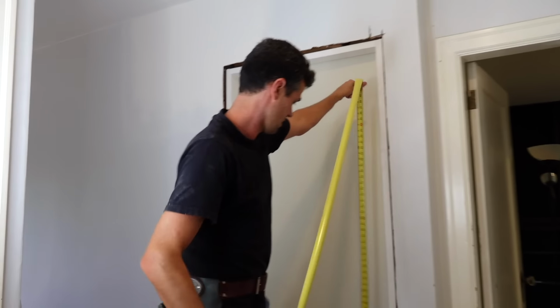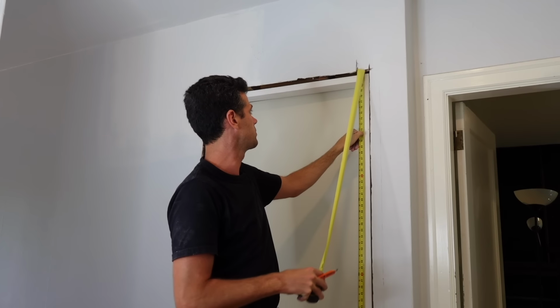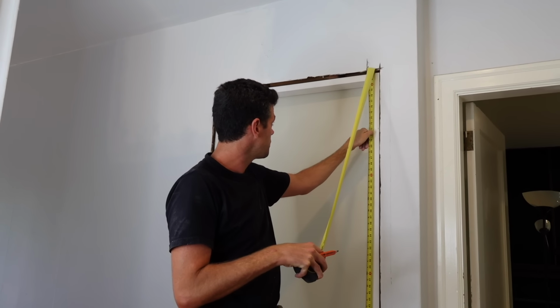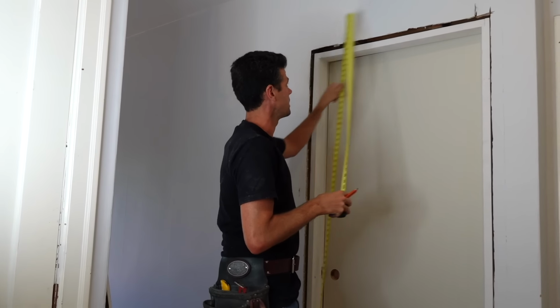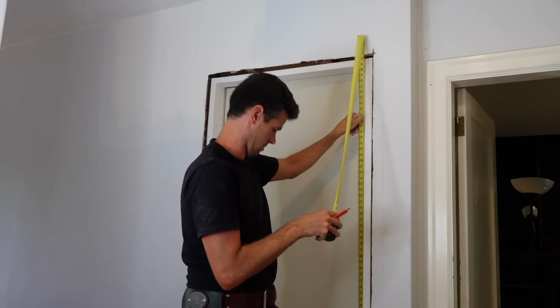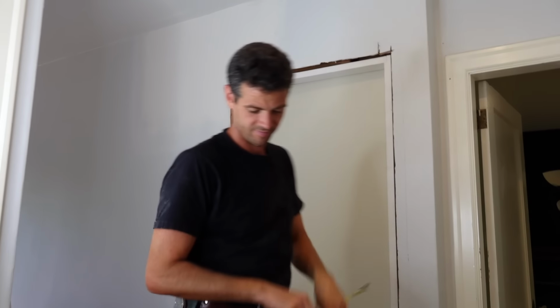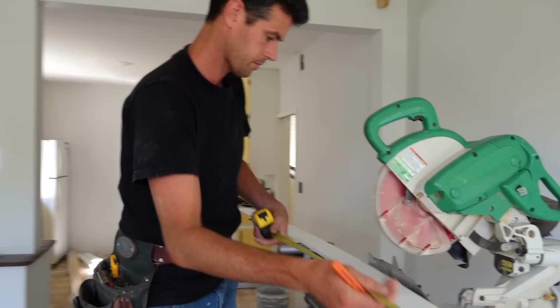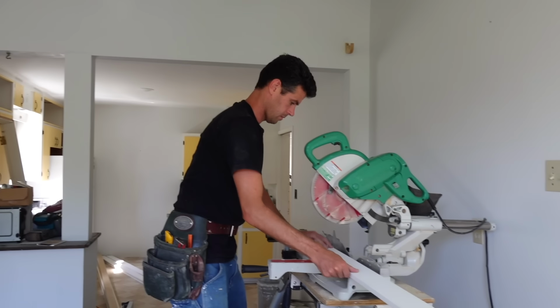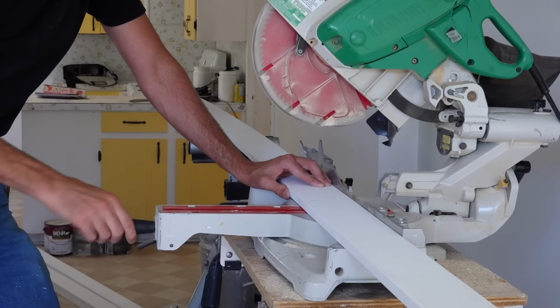So now I'm gonna do that real quick. But let's cut it a little bit long. We can do it to 83. Well, I need to cut it a bunch? 82? 82 is looking pretty good. About this side, yeah, it could almost be 82 1/4, but this part hangs down a little. I'm gonna call it 82 1/8. We all good? Yep. Except this is not on zero. Always check your saws to make sure it's on zero.